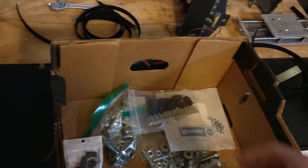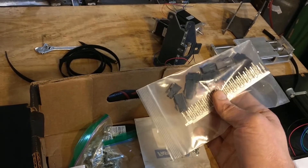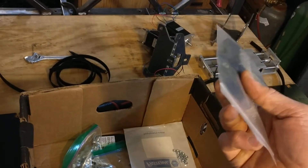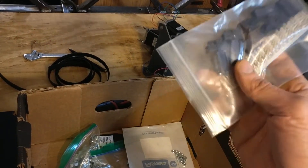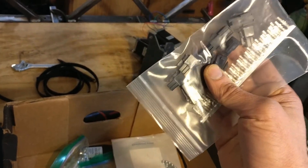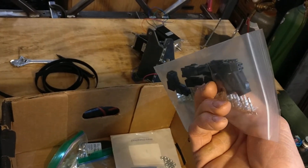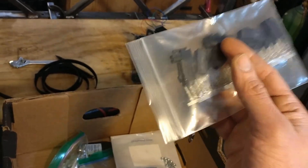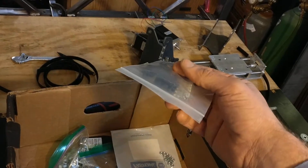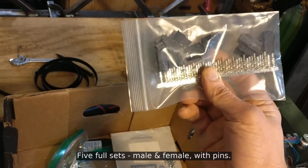For connecting the wires to the motors, I have these Molex connectors. I'm going with connectors rather than soldering directly because I want to be able to detach the motors when doing work on the machine. I picked Molex connectors because I'm familiar with them from computer work and I already have the crimping tool. These are the Mini Fit Junior series, not your standard Molex connectors. I picked these because they seem more robust and they have a higher amperage rating. The rating on both the standard Molex and the Mini Fit Juniors should be more than enough for the three-amp carry, but the higher the better. This was about $12.50 for five on eBay.